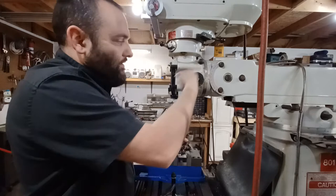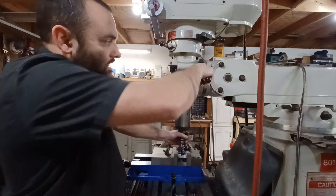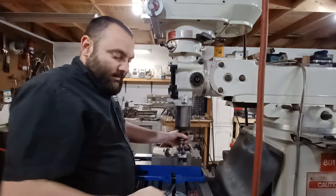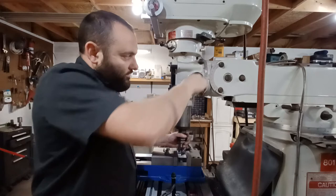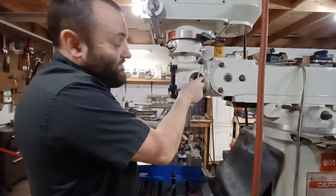Now I'm all the way down. When I lift up, it's going to turn in the wrong direction and undo it — I don't want that. So when I lift up I'm going to take a screwdriver and twist this to make sure it doesn't uncoil. That way I don't undo the 30 minutes of work in there. The only sketchy part about not buying the assembly is getting the old spring out — that's it.